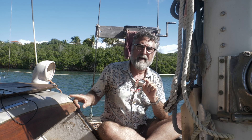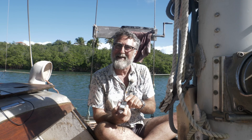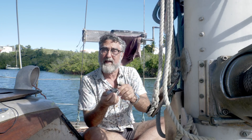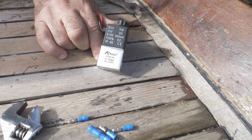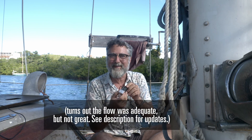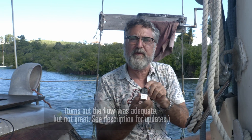The other reason is the solenoid that's on it is the standard one you see everywhere. It came with this boat 30 years ago and it's been a very good performer — probably around 50 years old — but it uses a whole amp at 12 volts to hold the valve open. This one only uses half an amp, so that's a little bit of electricity savings. Let me show you one last thing that's kind of neat. You can take the screw off and take it apart — this is the electromagnet and this is the actual valve, so it pulls up a steel plunger inside to do its thing. You could potentially just replace one side or the other. The only thing I don't know yet is whether the holes are big enough to flow enough gas for our needs — we'll update that in the description.